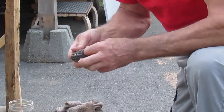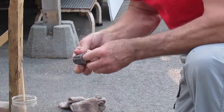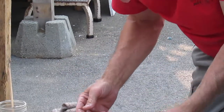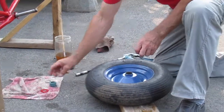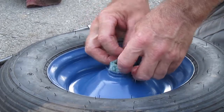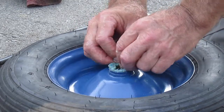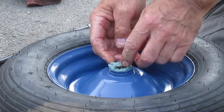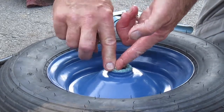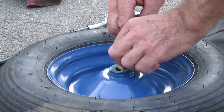I had only found one reference to this type of bearing on the internet that didn't show how to do this, so I thought I'd make this little video. I don't know how many people it's going to help out, but it's one way of doing it. So now I'm going to slide that down in there, and slide my homemade felt backing into there, and squeeze it into the gap as best I can. Its real job is to keep out the dust from the rest of the bearing, so it doesn't have anything to do with keeping the wheel going really.